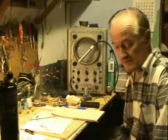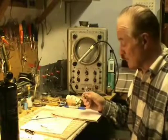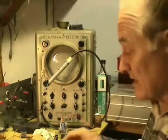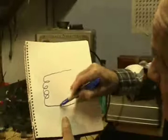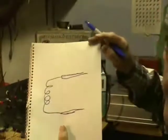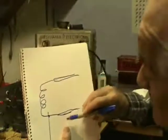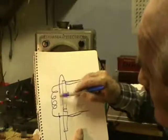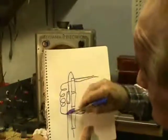I'm now going to start the internal construction of this hopefully successful electron tube. The first thing is to deal with the wires going to the filament of my automobile lamp. I have the automobile lamp filament joined to the larger wires from the existing bulb. I will bring up one iron wire and spot weld it there, and the other one I'll bring up with glass spacers on it, loop it over, and join the two with another glass spacer with the wires sealed into the glass tube.